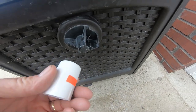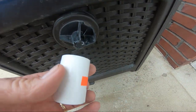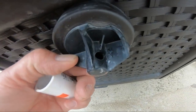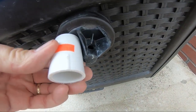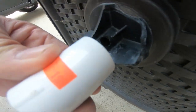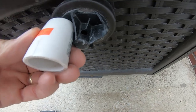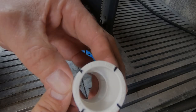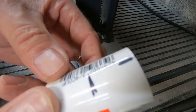The three-quarter inch coupling will fit over what is left of the broken hand crank. I've had this coupling for a while — it has a price tag of 19 cents on it. You can't buy anything now for 19 cents. In order to slide the coupling on as far as possible I cut slots, and this will help make a stronger connection. I make four marks across the end and will cut slots with the bandsaw.